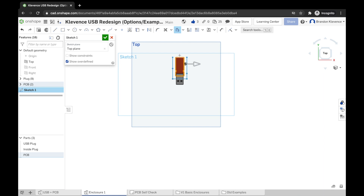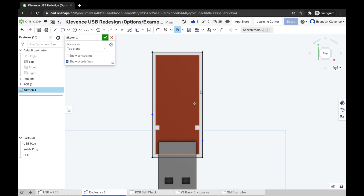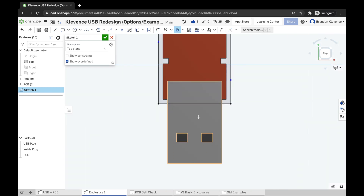Select all of the lines that make up our PCB — this printed circuit board, the red area here. If I hit Enter, it asks what offset distance I want. It's just redrawing these lines at a distance away from our circuit board. I'll set it to 1mm — you could try 0.5mm if you prefer. This is going to be the outline, or an air gap, between the inside of our future case and the outside.